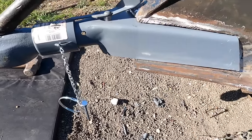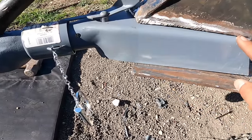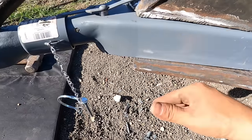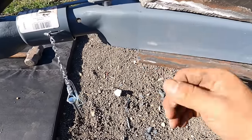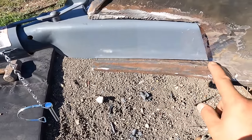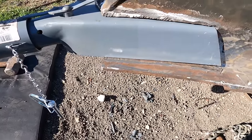This just does not make sense, period, because you had that cut there. You're relying solely upon this top weld, which is fine. And this, being that it has a slit, is hanging pretty much free, right? So it doesn't really make sense where it's grabbing the strength from. It's grabbing the strength from way back here. So it just doesn't make sense.